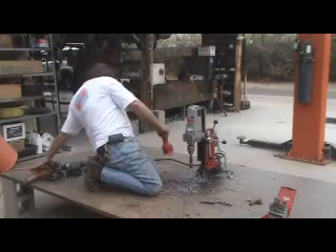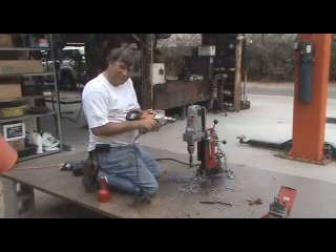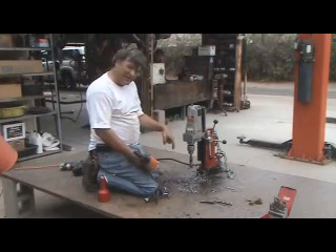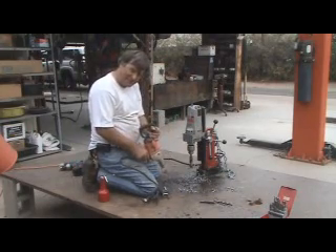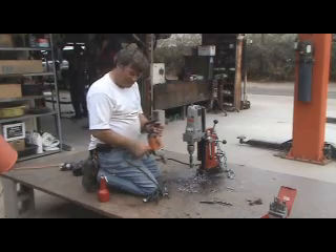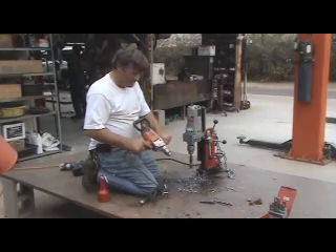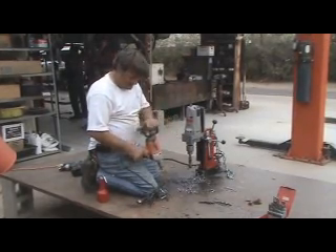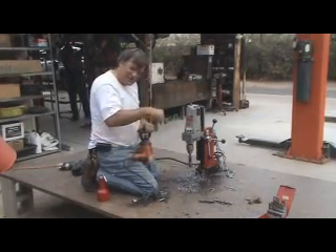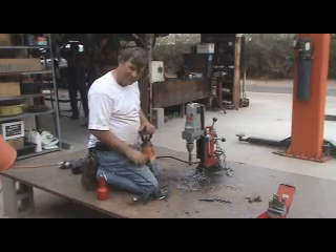See, I was doing it with this drill — big, heavy-duty, lots of torque, lots of power to it. But as the bit would start to get down into the metal, and if it bit in and the bit stopped turning, this handle comes around and it either whacks you in your shin or tries to break your wrist. Normally you would have two handles on it, one on either side. A lot of times you have two guys hanging on from either side, and another guy just pushing, trying to keep the bit buried down into the steel. If you let them just sit there and spin in the hole, they get hot, they lose their temper, they're dull. You've got to start over.